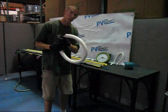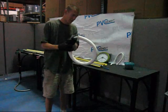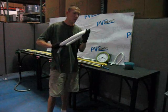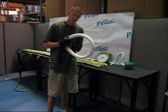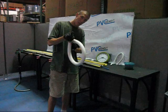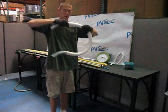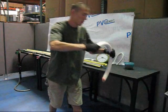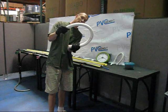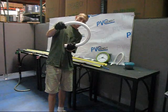I've never actually bent one and a quarter inch pipe this tight so I'm kind of happy right now. Once again, get our internal support in there. I'm noticing this is where my printing is — you pay attention to that. So I'm just going to pull it tight, make sure that any stretching that wants to happen happens now. And then when I come back, I can return very close to that position without any kinking. Now I can see it starting to oval there, so we'll just call it — that's pretty good.